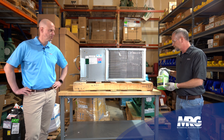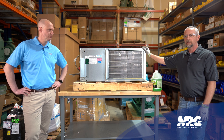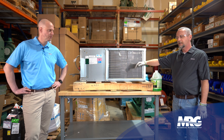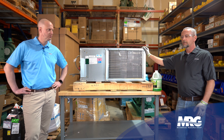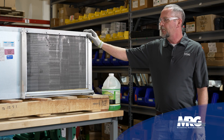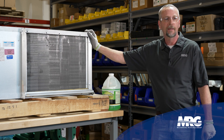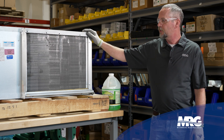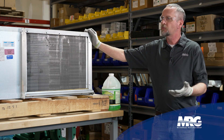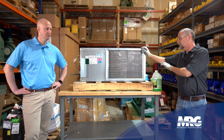The really cool thing about this style of evaporator coil cleaner is that it's what they call self-rinsing. All you have to do is turn it on in cooling mode — as soon as your coil starts getting cold and sweating, that condensation runs down into your drain pan and rinses the cleaner off for you. You don't have to come back with a hose or a vacuum.